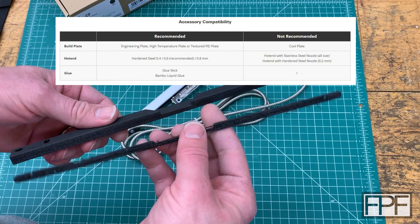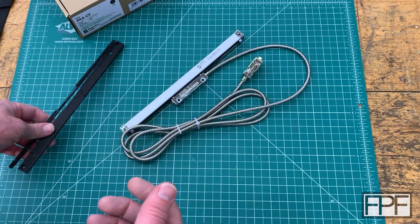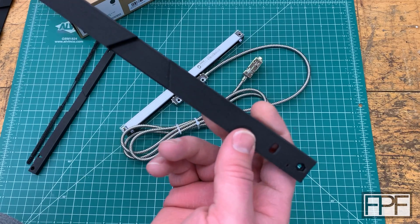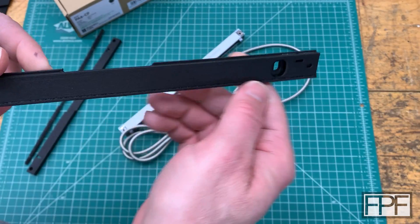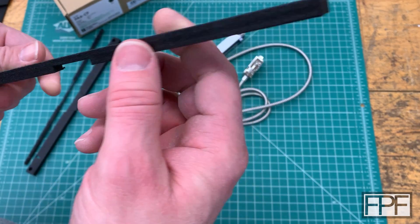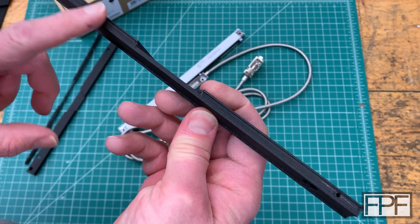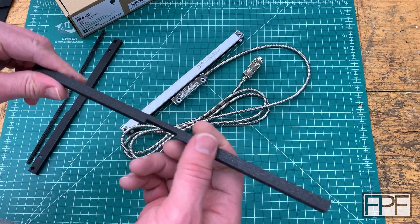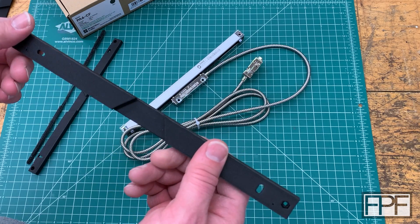This is the result I got, and I did try it again. The second one actually looks decent from a distance, but there is at least one layer where it is horribly under-extruded down near our ledge and it's going to break apart fairly easily. This one did get pretty close — I was tempted to try a third time — but because this stuff is so expensive, I feel like I'm just throwing money away. The 0.4mm nozzle is not the correct tool for the job.